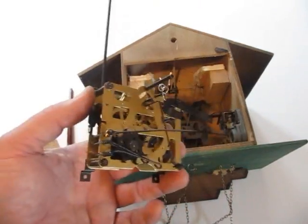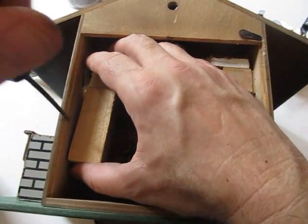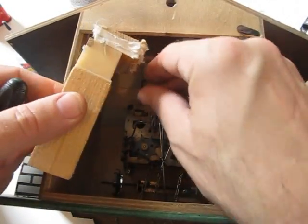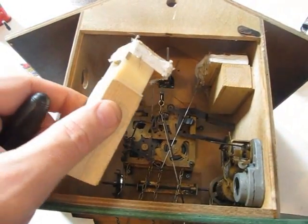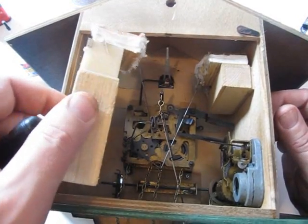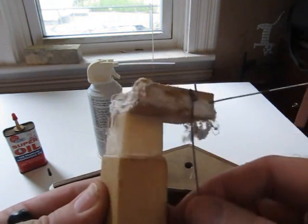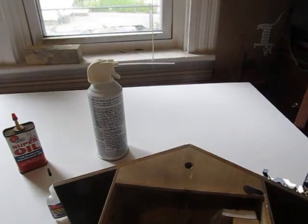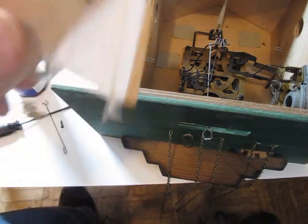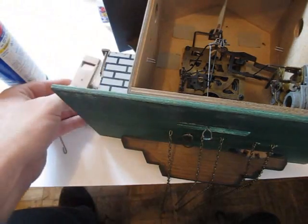It's really an ingenious little thing. So we take this clock apart. I'm going to take out the cuckoos — both of them. The longer one there is the deeper note; that's a long whistle box. I just took out the other one — the 'ooh' — and that one's kind of wrecked. You can see how the paper was all kind of wrecked. They are working, but I'm actually going to replace that bellows. I have a new bellows to replace it. This mechanism is just fascinating.